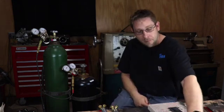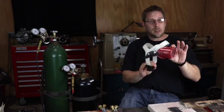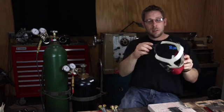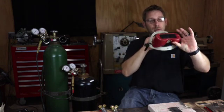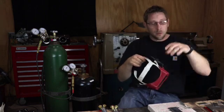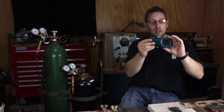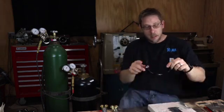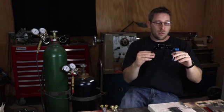We're going to talk about eyewear. We've got a few different examples here on the bench. This is a goggle style with a shade 5, plastic headband with an adjustable back strap. You can also flip the goggles up on your forehead for quick view. Next is going to be your cheaper goggles with the elastic. And then sunglasses with a shade 5 that you can get from your local welding store.